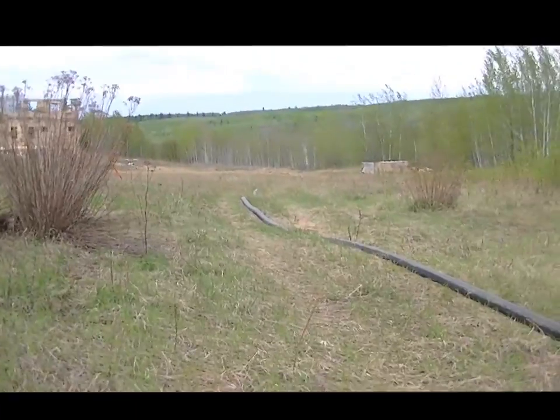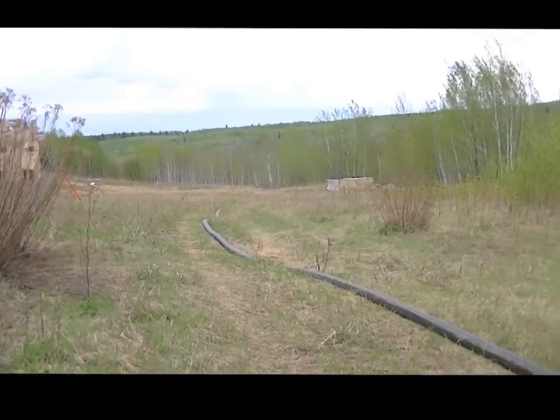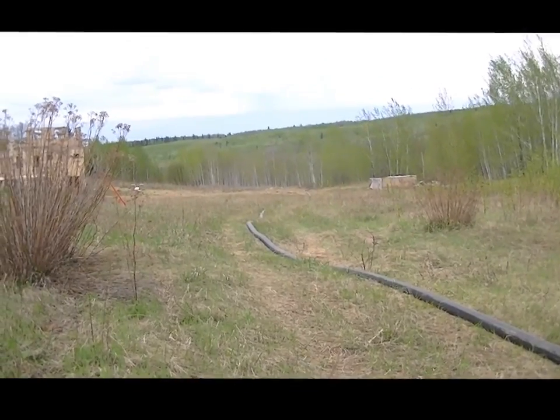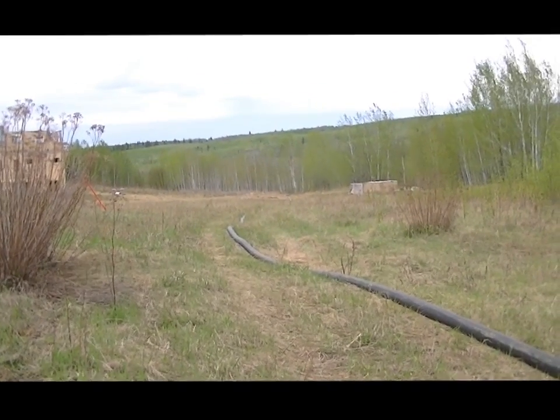We're 140 feet above the Athabasca River at this location, and we've got 2,100 feet of 4-inch lay flat out. Our pump is a Trident, 3,000 gallon a minute. It weighs 500 pounds, full of fluids.